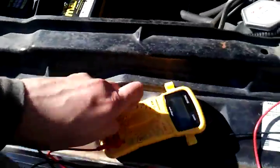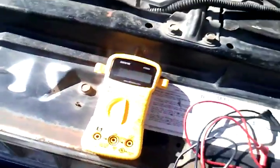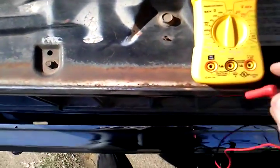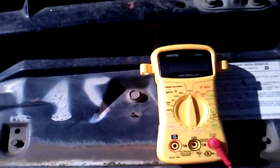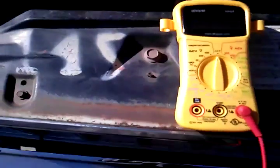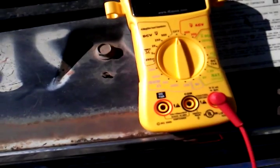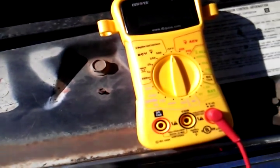We're going to start off with the multimeter off and with everything unplugged, the way you get it in the box. You take the red one and you plug it into the one that's labeled — it's the one on the far right. It's labeled MA and then it's got a little weird symbol and then a V. And then plug into the black central one, which means common.